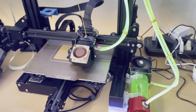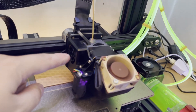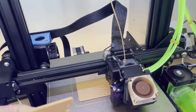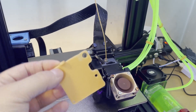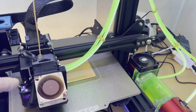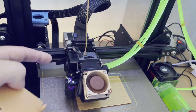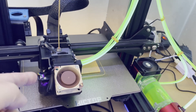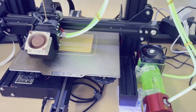But this is what you guys wanted to see — how it performs. Some things I want to mention: I took out the hotend fan, so this housing is empty. What I've designed to do is remix an STL file for the shroud — for the original one — to put it in the back and not use this shroud anymore. I've also remixed another part that takes the CR-Touch, so you can mount it as well without this part. This part will go in the back, and the CR-Touch will go on this spot, and then you won't need this shroud part at all.